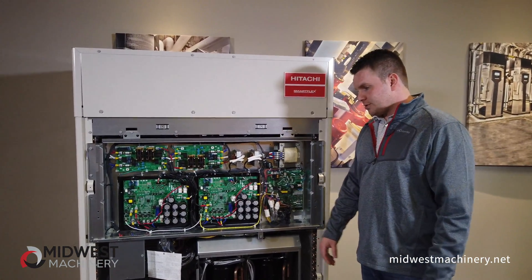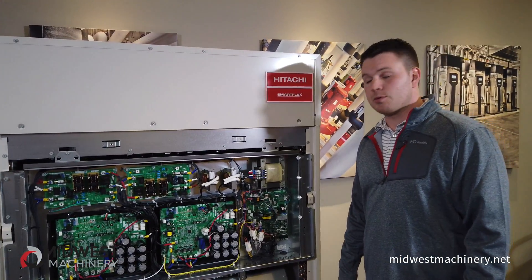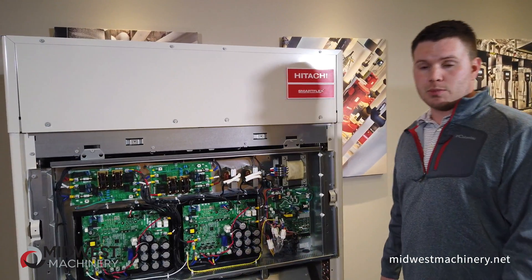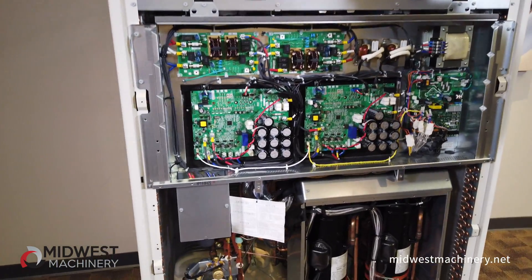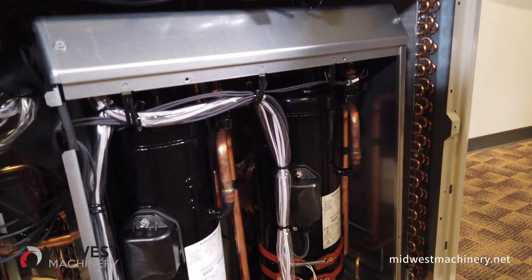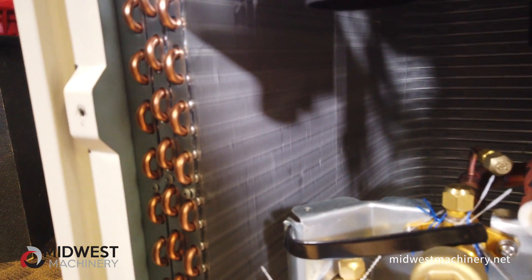Here in the St. Louis, Missouri region we have our hot, humid days but we also have snow. If snow builds up on the coils, we can go through a defrost cycle with continuous heating still. You're not going to have to shut it down and run a defrost cycle and lose your heating performance.